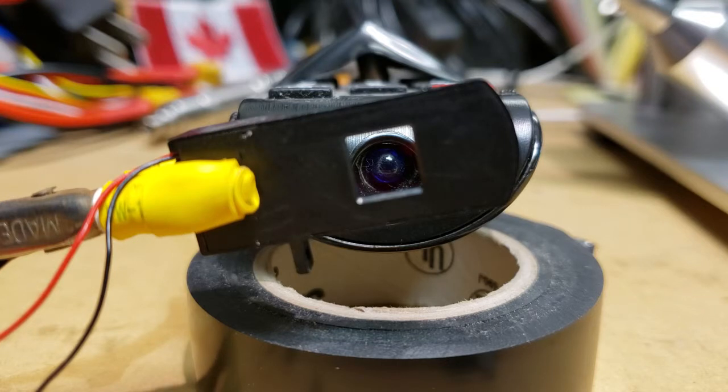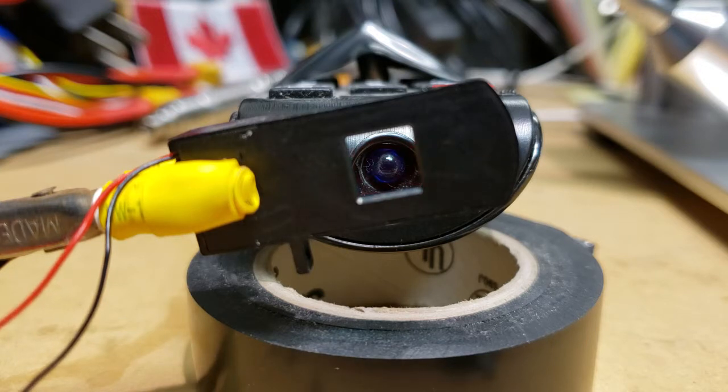The reason they do that on this particular camera is so that the infrared is filtered out during the day. Then at nighttime, it uses a little infrared LED to illuminate the area it's videotaping. So you get the best of infrared during the night, and it's filtered out during the day so you get good color rendition during the day.